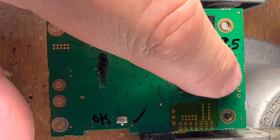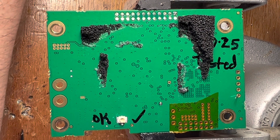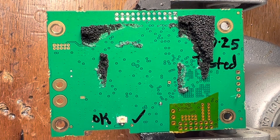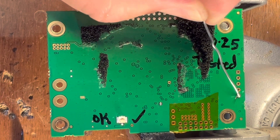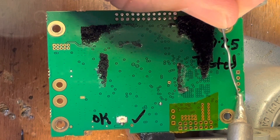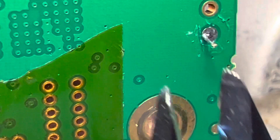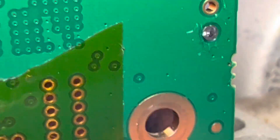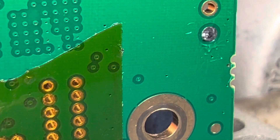We're back on the other side here. So here it is popping through the hole there. I'm just going to clean up the tip, and we'll hit that with a very, very tiny amount — actually, I'm going to run a little flux there first just to give it something. And here comes the solder. That looks good. My little flush cutter here to snip that little guy off there. And I think that should do it.